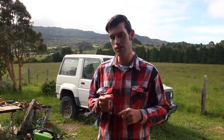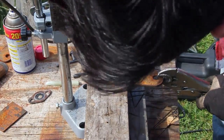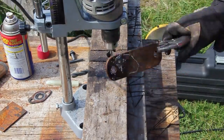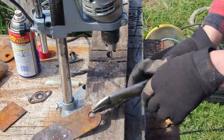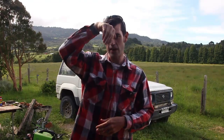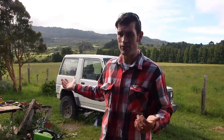And thirdly, I used one of those $20 cheap tabletop drill presses that you just push down like that, and you put a hand drill in it, and then you pull it down, and it makes it work like a drill press. Is it great? No, it's not. Do they work? Yeah, actually they do. You probably have to modify it slightly because, like, mine, when it goes down, it has a tendency to go inward, so it's not straight, so I had to modify it slightly so it goes actually straight down. But these are minimal things that have worked really well for a limited amount of money invested.